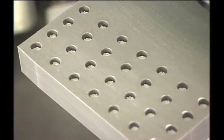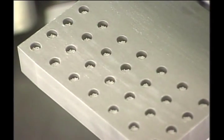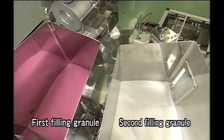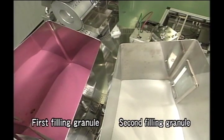In the case of granule filling, we use a filling unit with a weighing balance that can be adjusted individually. This makes it possible to fill capsules with a variety of drug products, such as sustained release, enteric, incompatible, or segregated materials. In addition, it allows three-layer filling including combinations such as tablets.